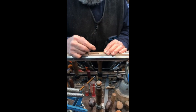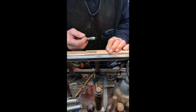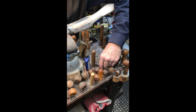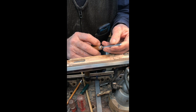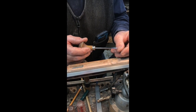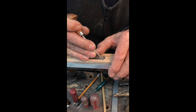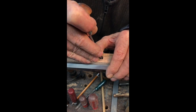These, what you want is a gouge with that curve. Now you could do that with a knife, the same knife that we cut some of the other moldings in, and just follow those two cuts down there. I would rather do it with a gouge, and for that I like to use my palm chisels. For this in particular, of course, it always has to be sharp, but it's got to be very, very sharp. And this is pretty close to the right curve, and I can just put that on there and press it and walk it in.